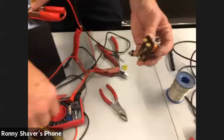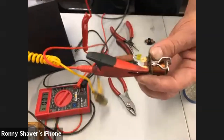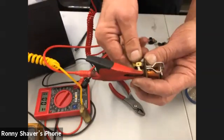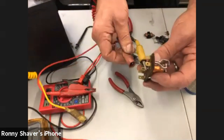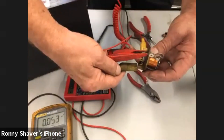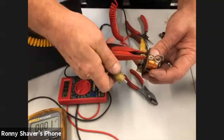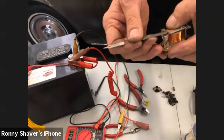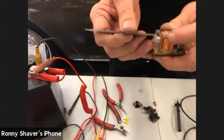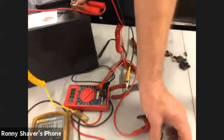You can test the contacts by putting our voltage feed on there, and you can manually actuate it. We know it works electrically because we've had it going. So what we've got here is a dirty connection, I'm pretty sure. We'll get a little file — a nail file — and just clean both sides, do the same down here. And you can check the continuity if you want — that's another good exercise.